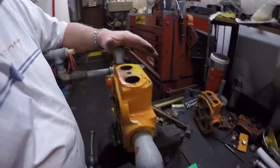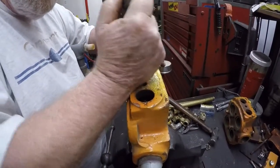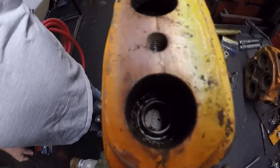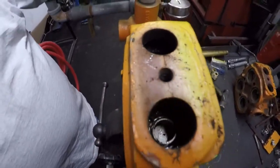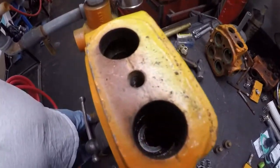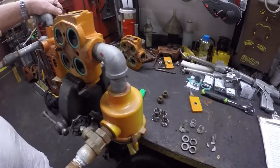There's the first side we have out. We're going to do the exact same thing on the other side. Now we have both valve seats out on the top side. If you look back down in there, there's more springs and valve cages as well as seats, so we're just going to repeat that process again. We got all four valve cages, valve seats, and springs out — you can look down in the head and see they're removed. We're going to remove the head from the vise and flip it over to repeat the process on the other side, starting by removing the plate.